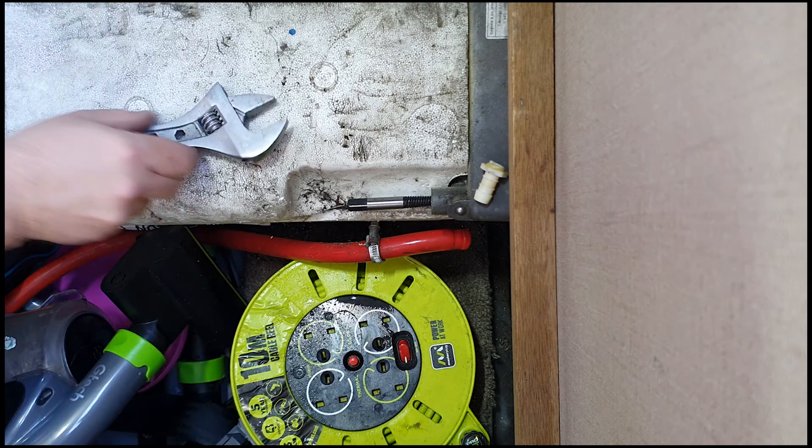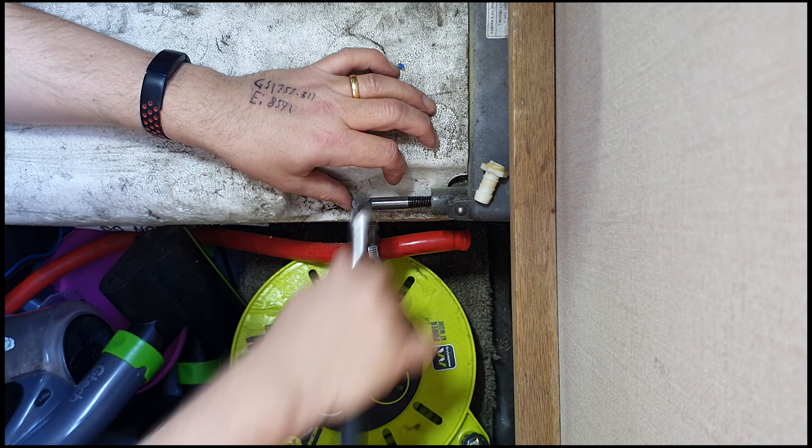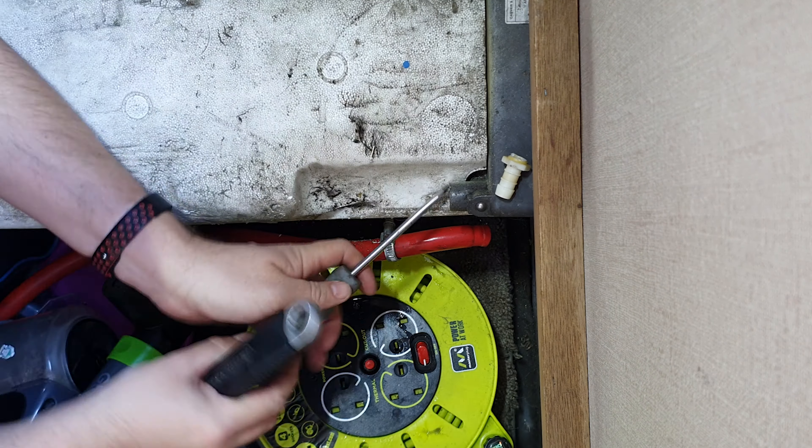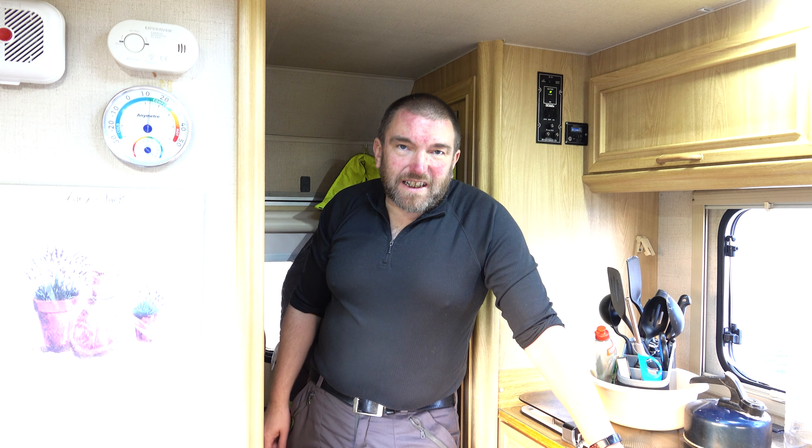So the first thing I'm going to try is getting it out with a screw extractor. Unfortunately that didn't work as easily as I'd hoped. I didn't want to go too mad with it because as you screw that in you're effectively creating an expanding plug, and that aluminium tube thing it screws into is not very thick — so I didn't want to crack the aluminium. Next thing I want to try is just wedging a screwdriver in and trying to tap it round a little bit. No, that's not working so great either.